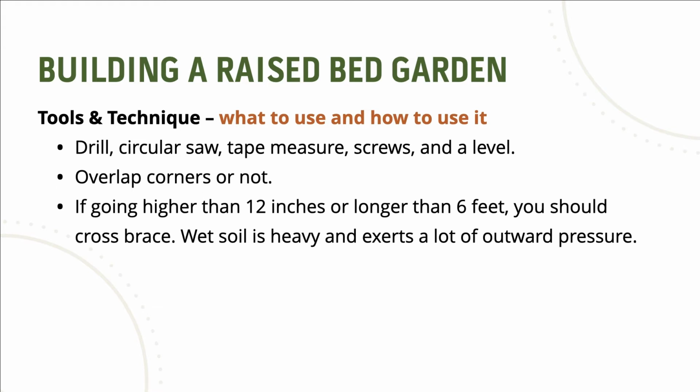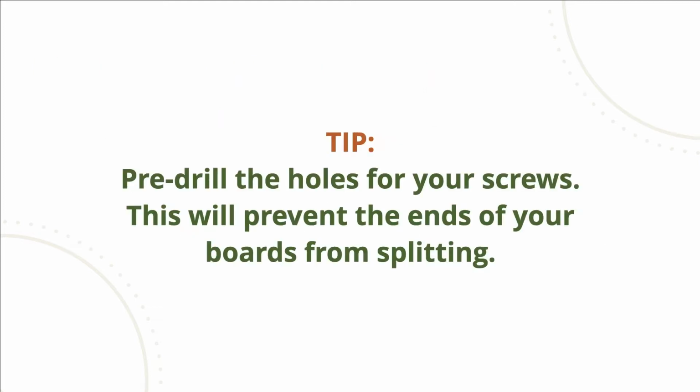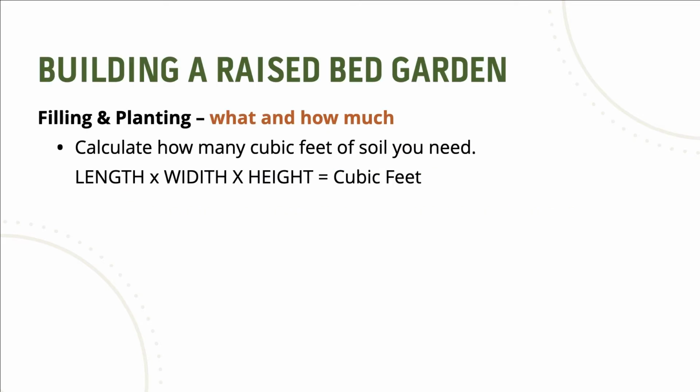You can overlap the corners or not. If you're not sure what that means, try YouTube or leave a comment below and we'll try to answer that for you. If you're going higher than 12 inches or longer than 6 feet, you should cross brace because wet soil is heavy and it exerts a lot of outward pressure. And one important tip, pre-drill the holes for your screws. This will prevent the ends of your boards from splitting.